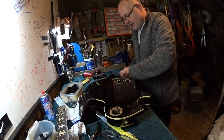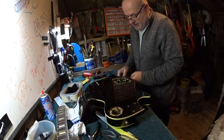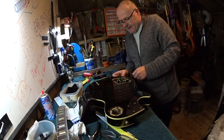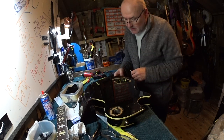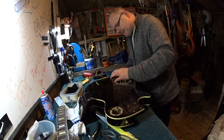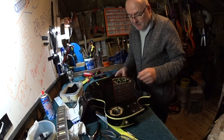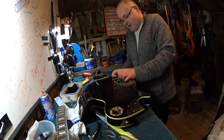then go for the hidden part of it, which is the jack socket, which sits hidden inside the tunnel. And if there's going to be something wrong with it, it's almost certainly going to turn out to be something to do with that. That looks as though it's well connected for the time being. I don't see there necessarily being a problem with that. So if there is this big buzzing grounding sound, we're going to have to track it down to somewhere else.